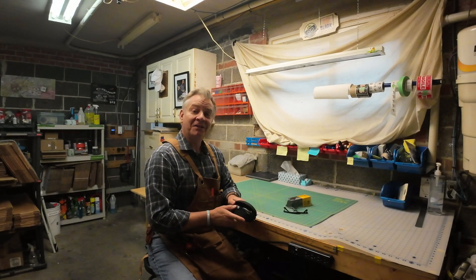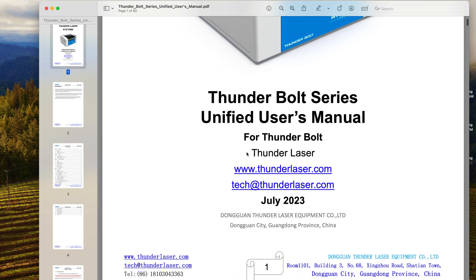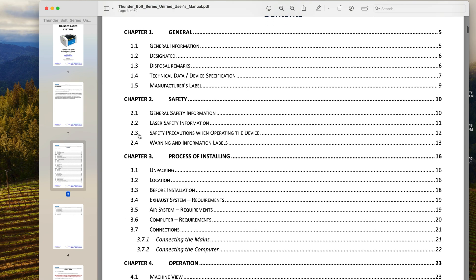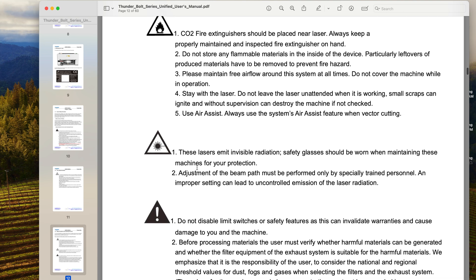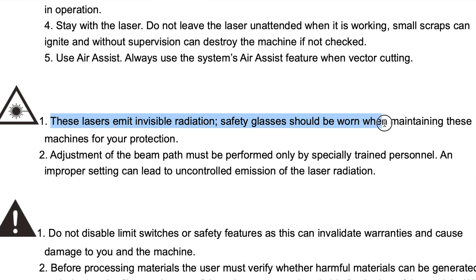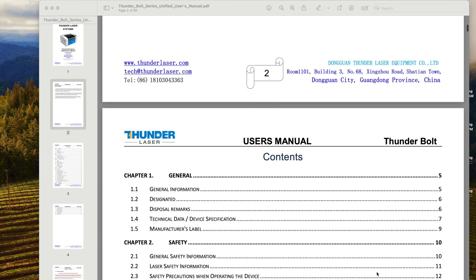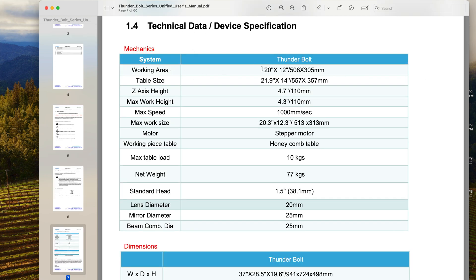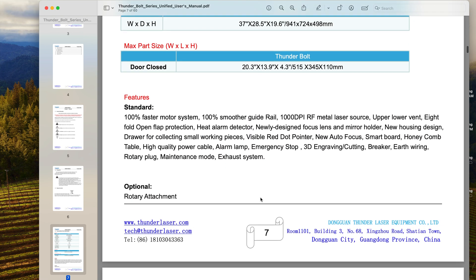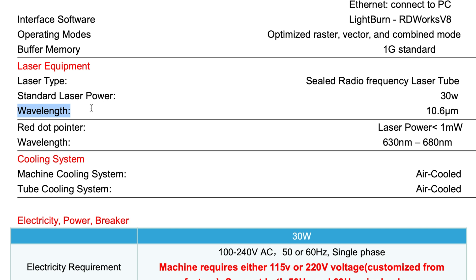Safety glasses — but not just any safety glasses. You need laser safety glasses, which are quite different from regular shop safety glasses. I got this pair off Amazon.ca. They're specifically needed when you're using the unit with the front open, such as with an oversized piece of material, or when engraving something with a reflective property. Check your laser manual for the wavelength of your CO2 laser — mine is 10.6 micrometers, or 10,600 nanometers. On Amazon there were many options, but only a couple that covered protection for a laser that strong. This pair is EN certified and CE certified.